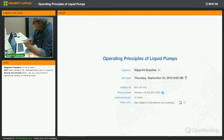Personally, Kenny, I would replace the pump. Why? Because the price of a pump is fairly low. But if your peristaltic pump still has good gears on them, then you could consider replacing tubing. What actually happens a lot is that people just order a couple of meters of tubing and keep it in their spare part kit. And if they are facing issues, and you will see it quickly if your maintenance station is full of ink, then it's possible that your tubing is so far degraded that leaks occurred. Then you can quickly replace the tubing inside the pump and continue printing on the same day. But I would replace the entire pump if I have it available, or after I replace the tubing, I would order a new pump and then replace it. So replacing tubing is possible, but personally, I see it more like a guarantee for my production.